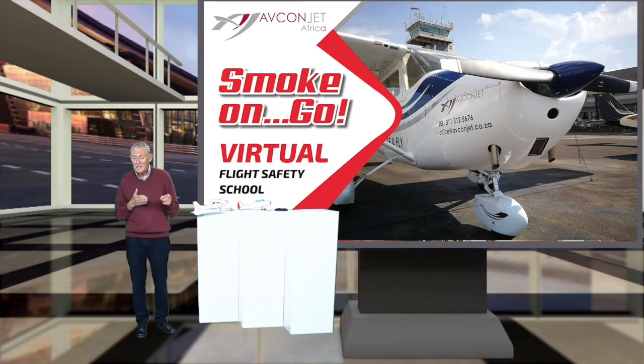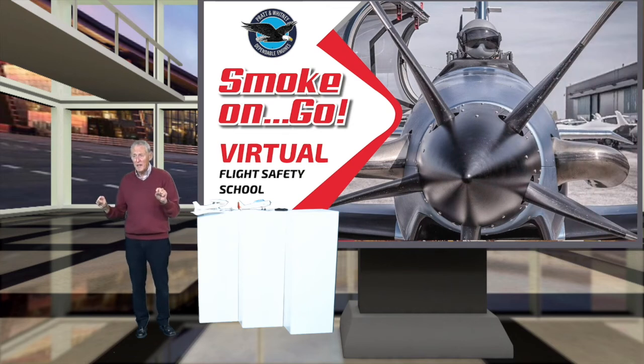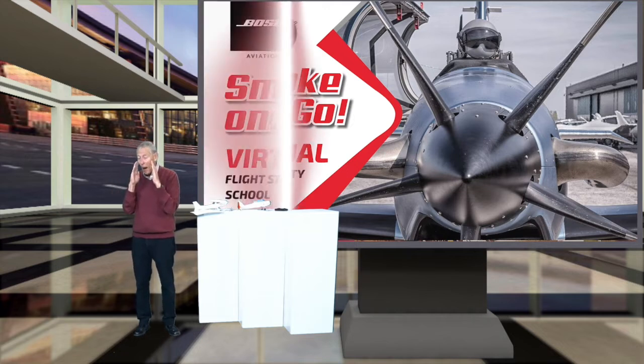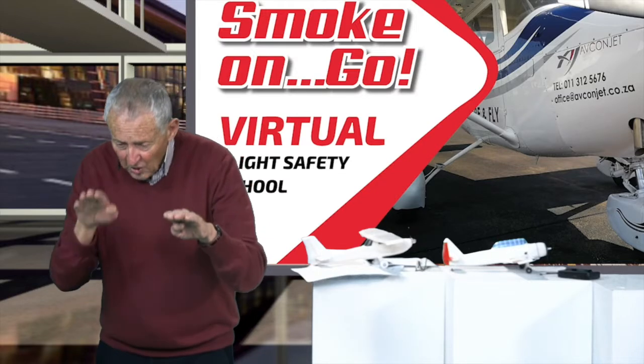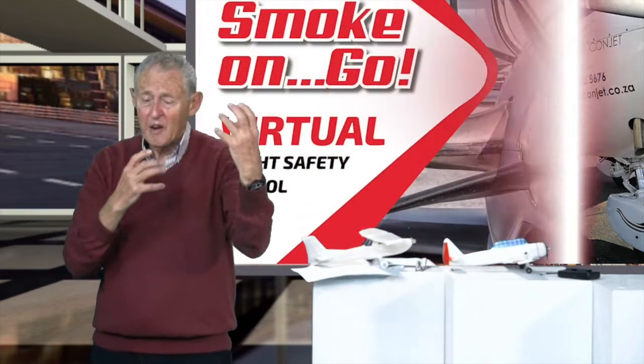In order to do one of these landings, Cat 3B, where you've got a 0 foot decision height, you need three autopilots. And all three of those autopilots are talking to each other. Even when you've got two, they're talking to each other. And when I say they're talking to each other, what I'm saying is that they are comparing the signals, the signal strength, the deviations that are being recorded, et cetera. A comparison is being made between all the data that those autopilots are receiving and which has been transmitted to the autopilot by the radio receivers.